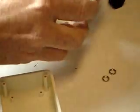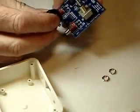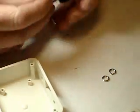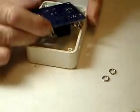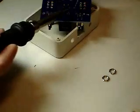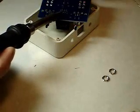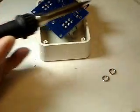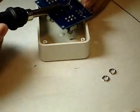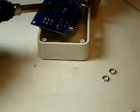The next piece that goes on is the cable connector. You need to make sure that the wires go in the holes before you snap it in place — it should click in firmly, push down. Once again, we can use the box to hold things. These connections don't need much solder; they're very fine. Because these are so close, it's always a good idea to do a quick check to make sure none of the solder has bridged connections.